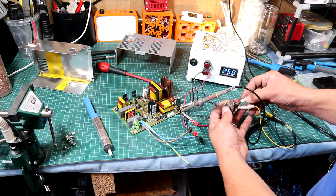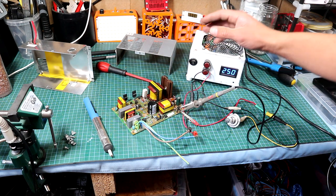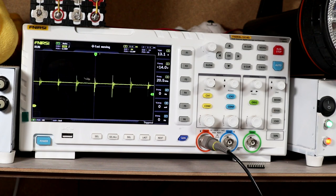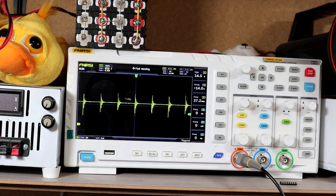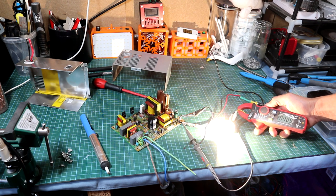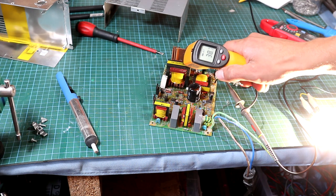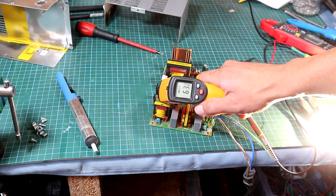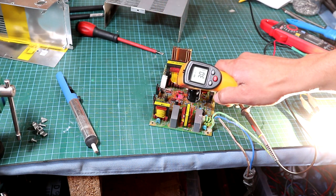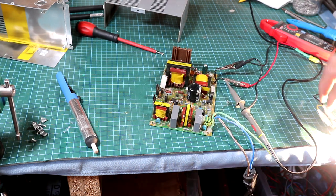For the load I'll use a small halogen lamp - one usually used in cars. I first have to remove the test unit box as it's limiting the power going to the board to about 70 watts. With the PSU up and running, looking at the oscilloscope, the harmonics are a bit smaller and the frequency has gone down. Checking the current through the bulb: we have about 4 amps at 13.8 volts, which is about 55 watts. Checking the temperature - the power MOSFETs are getting a bit hotter. Without a heatsink we can't run it too long. The output diode is getting a bit warmer as well, the transformer not so much, and the high-power resistor is getting quite hot.